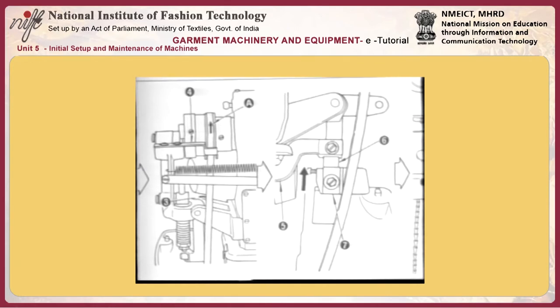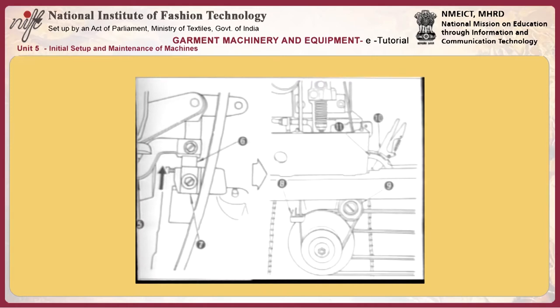Lifting up hook lifting lever 5 in the direction of the arrow, pass the belt through the space provided between latches 6 and 7. Put the belt in belt shifter 8 on the speed reduction gear side and put the belt on tension pulley 9. Put fixing claw 10 in the groove on ratchet 11 as counted from the bottom to tense the belt.